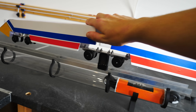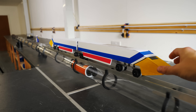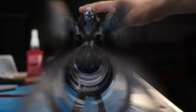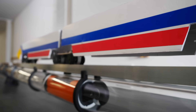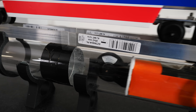Time for the next test to see what needed improving. Unfortunately I found out I'd need to do quite a bit more work. Although initially the piston design looked promising, it turned out that with the high tolerances I'd built into the 3D printed seals to the tube, there was way too much friction, as the thrust carriage kept rubbing against the sides of the tube. I adjusted the wheels and tried different magnet combinations, but often the magnetic coupling would release as the train passed over the joints in the acrylic tubes. This join was going to be a bit of a problem.